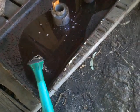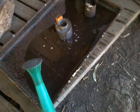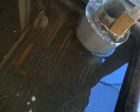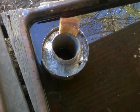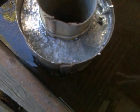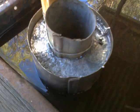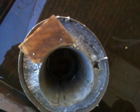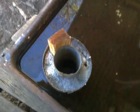Just give the wood a bit of access to some thermal mass. And behold, a water-cooled mould with a wooden base. No steam explosions. And because the outside of the mould is a stainless steel chimney pipe, you just undo the seam to take the outer side off, cut the wire and press the steel drain pipe out of the inside.